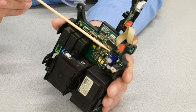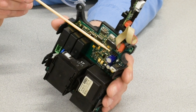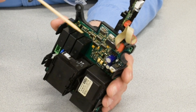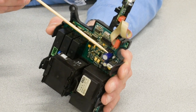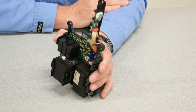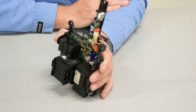The 8/2 motor needs to have this jumper located on pins 1 and 2 of this 5-pin plug. If you have a comm that's silver and predates 2010, you'll want to move this jumper down to pins 2 and 3. If you forget to do it and start up the old hoist, it'll produce an error code to tell you to look at the position of that jumper if you use the troubleshooting chart.